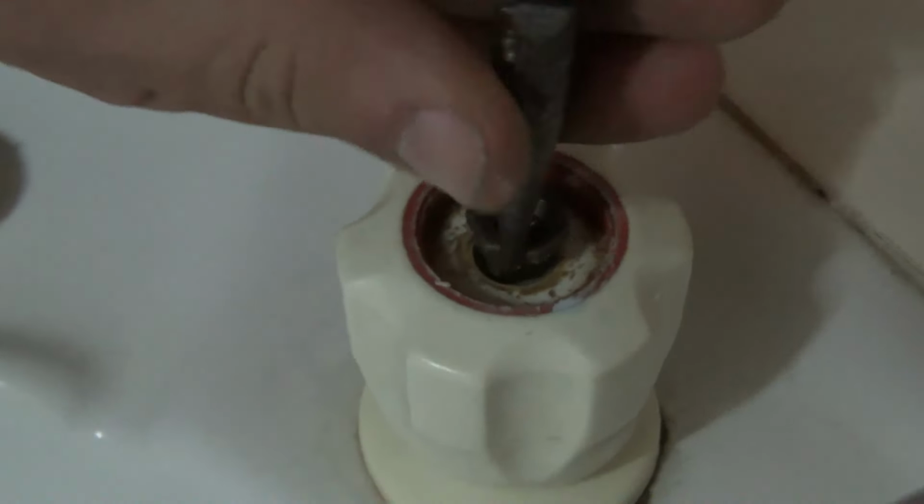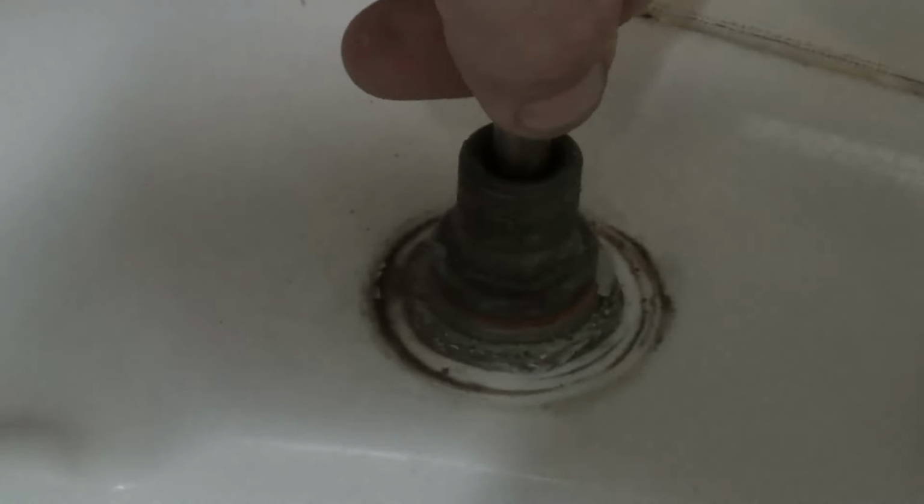Now, once the nut is off, we can remove the handle. Underneath the handle is, in this case, a plastic handle drive nut. We remove the drive nut. And now we have access to the shroud. Now the shroud comes off in the same way. Unscrew it in an anti-clockwise direction. Okay, off comes the shroud. And underneath is the exposed spindle. We can see the spindle exposed.